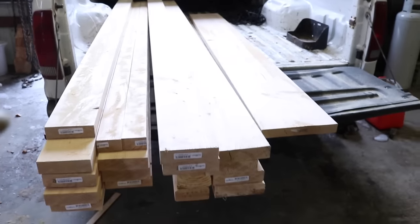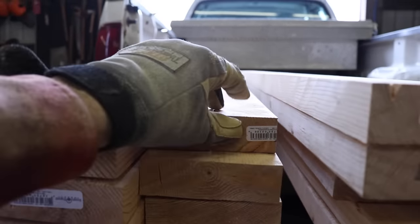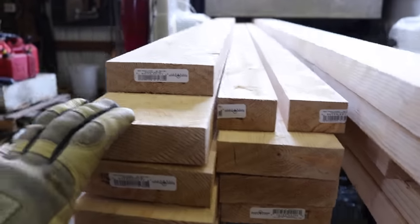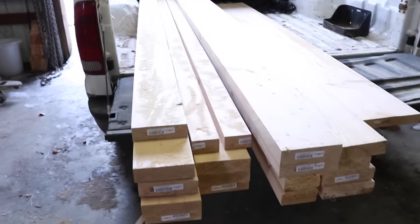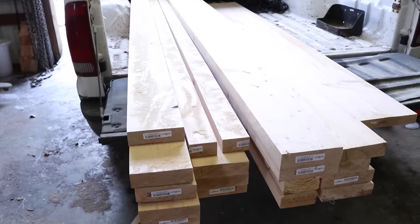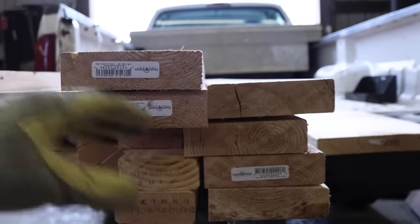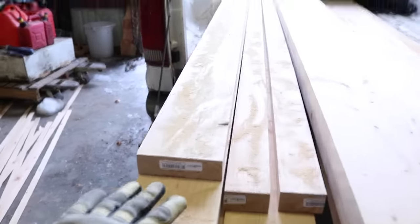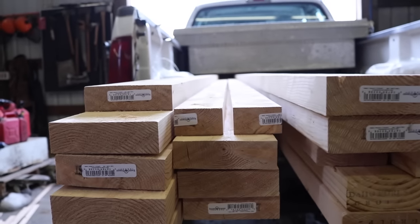Here's the package broken up into its three respective piles. This here is going to be the tabletop — eight 2x6s and then two ripped at 2.5 inches, so that's also one board cut into two. Our bench is going to come out to 25 inches of depth, which is pretty good — any more than that and it gets kind of hard to reach the back. Here is the framing for the bench itself, and then of course the shelf. I only ripped both sides on the tabletop boards; the others I ripped on one side because they'll be ripped again to various lengths.